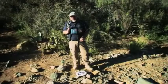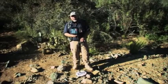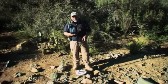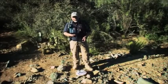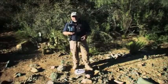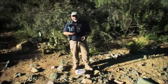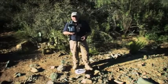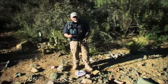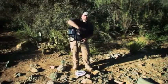The first time you ground balance in the day, you'll use your track fix button. Now the machine's already in the fix mode, so we're going to start pumping the coil up and down about 1 to 4 inches off the ground and flip it from the fix mode to the tracking mode. You hear the machine stabilize? That's perfect ground balance. Now once it's stabilized, flip it back into the fix mode, readjust your threshold just a little bit, and you're ready to detect.